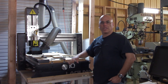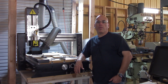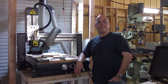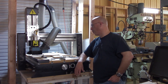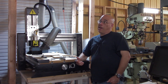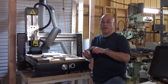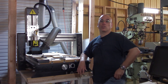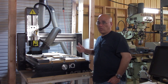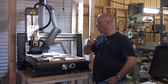To be honest, this is a different environment. A machine like this is not meant to do everything a milling machine does. This machine is mostly for making plaques and little trinkets — not car parts or motorcycle components. Can you do some of those? Yes, but you're going to struggle a lot when you need many features and different tool positioning methods. It's not impossible, but it's definitely not the best environment unless you change the controller and transform it into something equivalent to a milling machine — and even then it's still a router.